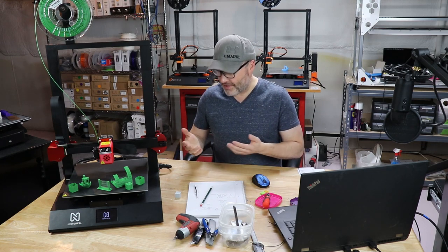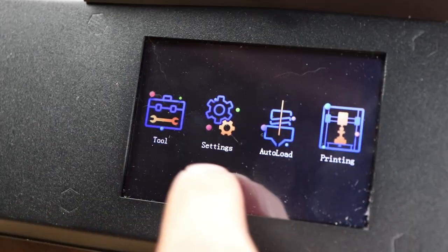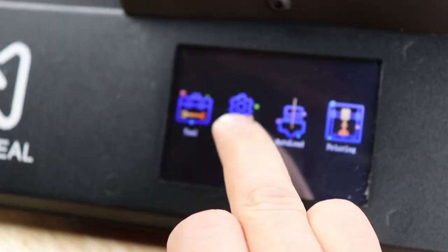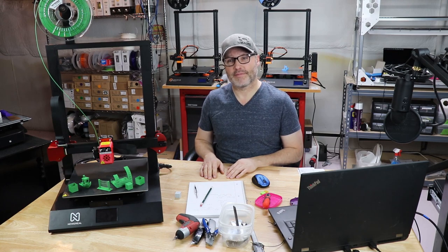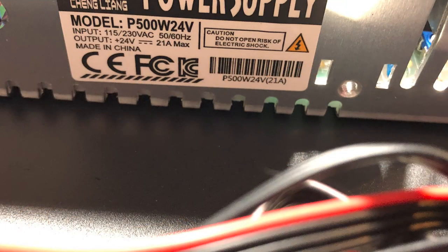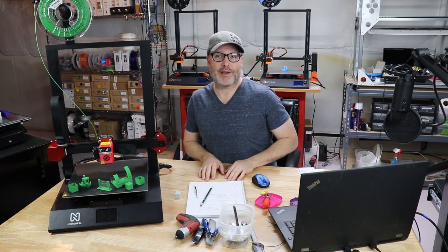It's not obnoxious — a little louder than I was expecting, but not bad at all. On the side there's a USB port and an SD card slot. On the front there's a 3.5-inch touch screen. It takes a little getting used to — sometimes needing a double tap — but after a couple of uses you figure it out. On the power supply, I have a screenshot: it's a model P500W 24V. The website says 360 watts, but by that sticker I'm guessing it's actually 500W — someone can correct me in the comments.